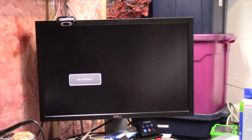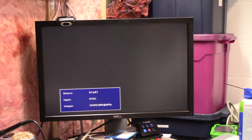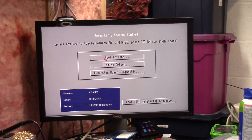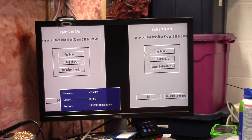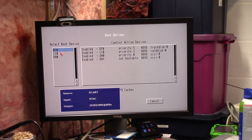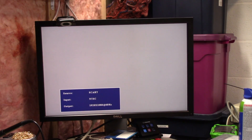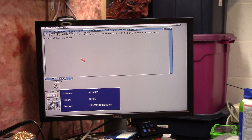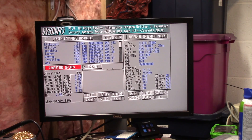External, 8 megs of RAM — I'll take it off and put it back on. Turning on. Hard drive light is doing its thing and... no memory. Pressed return for 31 kilohertz mode — expansion board diagnostic says it's working. Boot options: DF0, CC0, DH0. Not disabling CPU caches so it boots. It sees 2 megs of chip. Which Amiga? 27.8 megahertz — this is supposed to be 40. You suck.